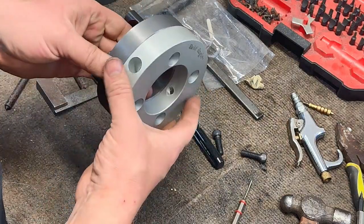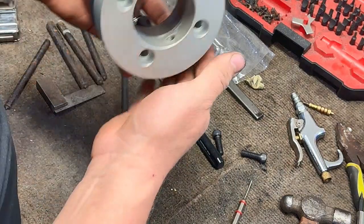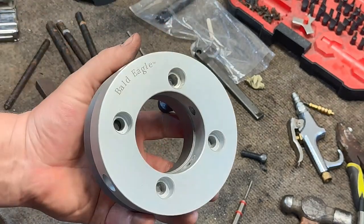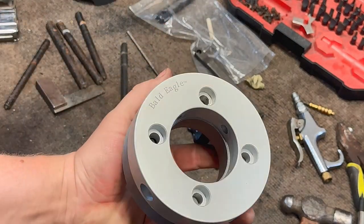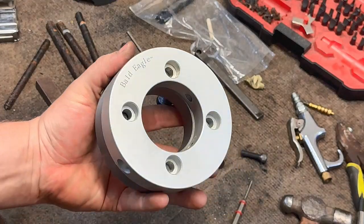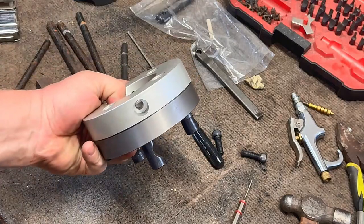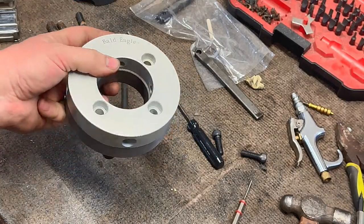As you've noticed, I didn't use the four pre-drilled holes in the spider provided by Grizzly. One of those holes will line up with the cam bolt on the back no matter how you rotate it, so that's why I had to go ahead and drill new holes from my D14 backer plate.